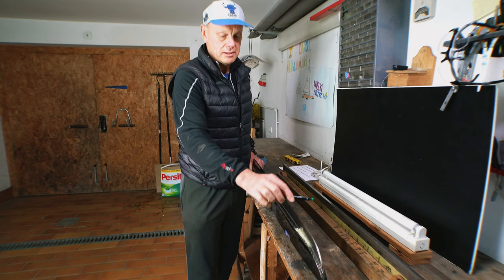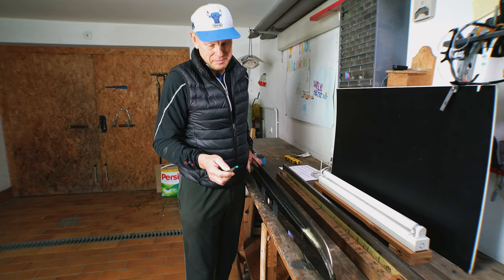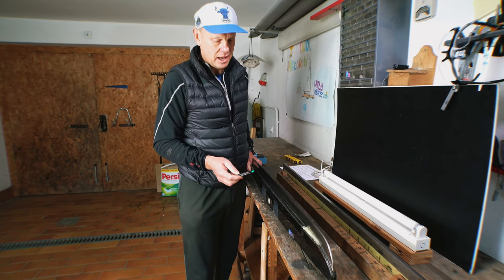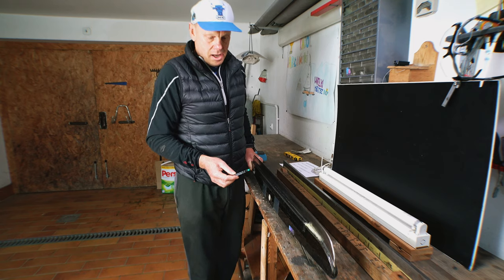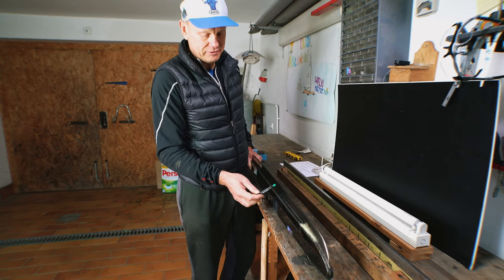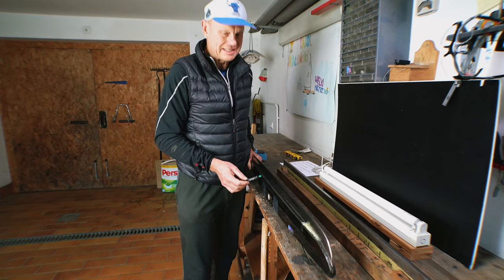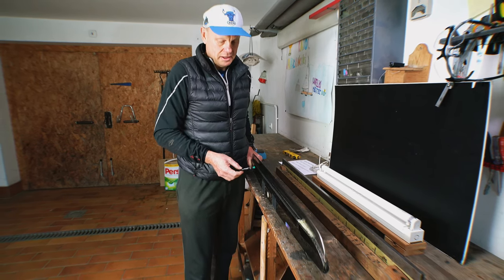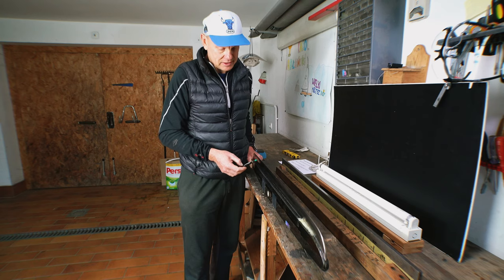And what about the angle? This is always a good question, and it mainly depends on the conditions you want to use the runner, and depends as well on the weight of the sailor. And for my weight, I mean 85-90 kilos, I mostly use 95 degrees angle. I have one set of runners with 90 degrees, which is mainly made for black ice and strong breeze. And then I have a few runners with 100 degrees, which are fast on the softer ice